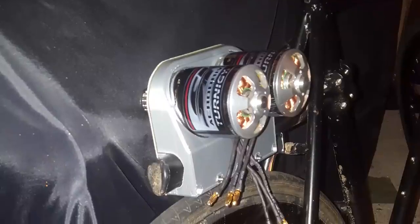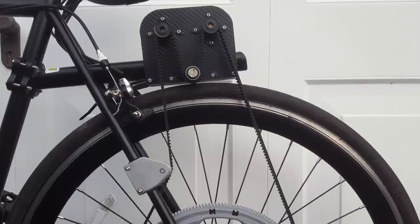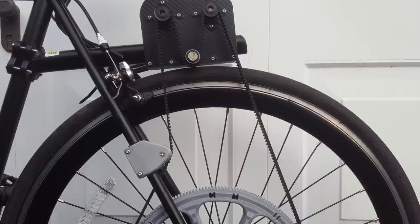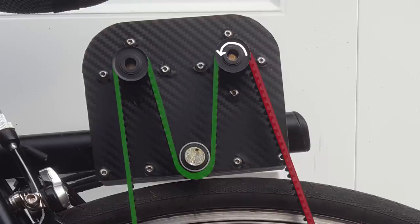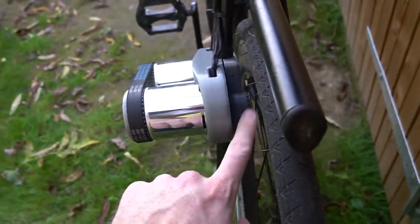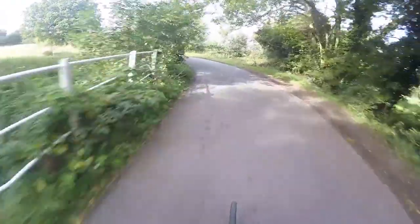This began my quest for more power, so I built a ridiculous setup — two motors attached to a bag rack above the rear wheel, linked together via a single belt to drive the rear wheel. But it never rode more than a couple hundred meters. As one motor applied torque to the belt, it increased tension on one side but decreased it on the other, causing the belt to skip and rendering the second motor useless. I then made a mount with one output pulley driving the main belt and a secondary smaller belt connecting the two motors, which worked surprisingly well.